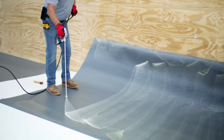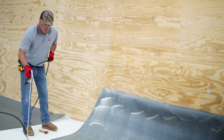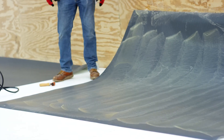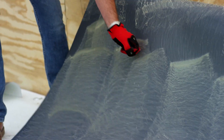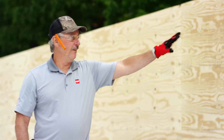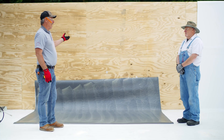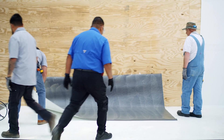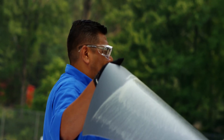We're doing pretty decent on that one-inch overlap. If we get a little glue on the sheet, is that a problem? No, but you have to wait until it dries. The worst thing you can do is try to clean it up right now. With help from our friends, we got this halfway up the wall — the rest of it is glued. This wall is not perfectly flat, so you're going to have to deal with that. You might get some wrinkles here and there; it's not the end of the world. Take your time and work them out.